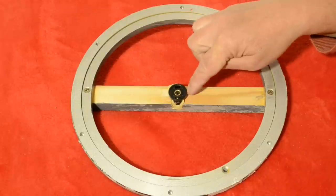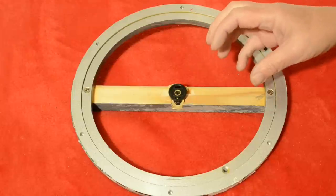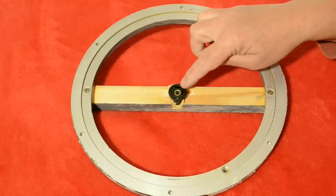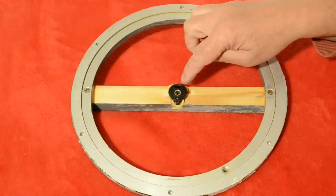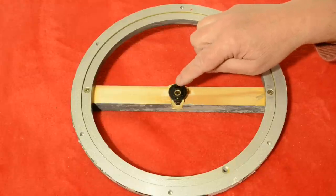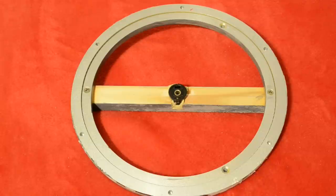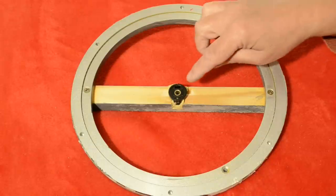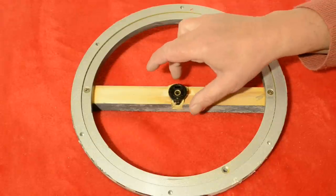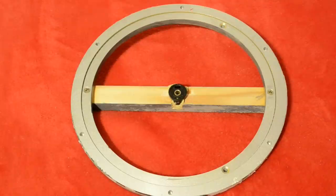I had to cut into the wood here to make a really stable attachment to the motor shaft, because this radio knob has a brass insert which fits the shaft and the grub screw. This makes a very positive attachment to the motor, and it's fixed in place with some epoxy putty, so it seems quite firm and solid.